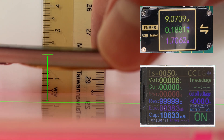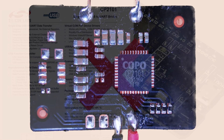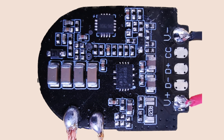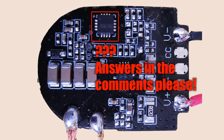The PCBs are remarkably simple. The receiver board has just one IC on it along with some passive components. The CP2101 - which should not be confused with the very common USB to UART bridge chip we find on a lot of dev boards - is doing all the heavy lifting. It's pretty amazing how much is packed into this one chip. On the transmitter side we have a couple of ICs. The JW7951C is the transmitter chip, responsible for driving the coil and providing information on what the coil can see. The other chip is a bit of a mystery - it's probably some kind of microcontroller and power delivery control chip but I can't find any reference to it anywhere. If you know what it is then let me know in the comments.